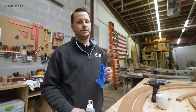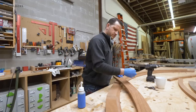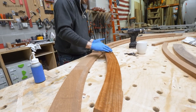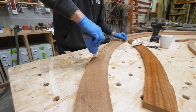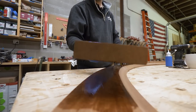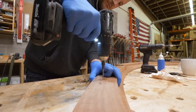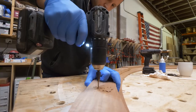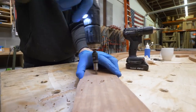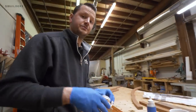When using these glues, you are going to want to use gloves — this stuff stains your skin and will take days to come off. Make sure both surfaces are dust free. When using polyurethane glues, you actually apply water to one side of the glue joint just to dampen the wood, and the water is what causes the polyurethane glue to activate. As we go through and glue, we're going to do one piece at a time, but we're also going to screw them down as we go. Put screws toward the back side so we don't run into them when cutting with the next molder pass. Don't forget the edges, since that is a surface that will be contacted.